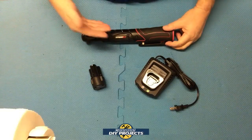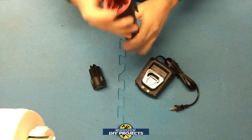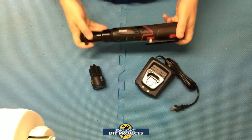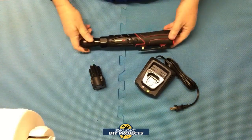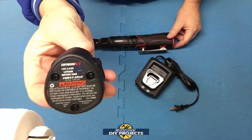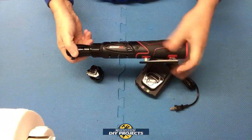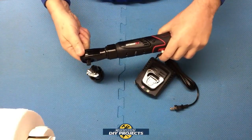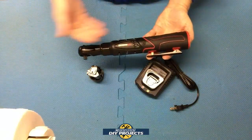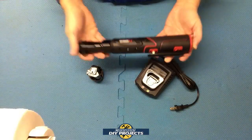This comes with a 90-day warranty. It has 60 foot pounds of torque and a metal body — this part and this part are all metal, while the handle area is plastic with a rubberized over-mold for easier grip. It has a no-load RPM speed of up to 170 RPMs, a 2 amp-hour 12V lithium-ion battery, a variable speed paddle, and a slim body compared to some other manufacturers. The forward and reverse switch is on the back. The length is 12.6 inches by 1.8 inches, and the weight is about three pounds according to their website.